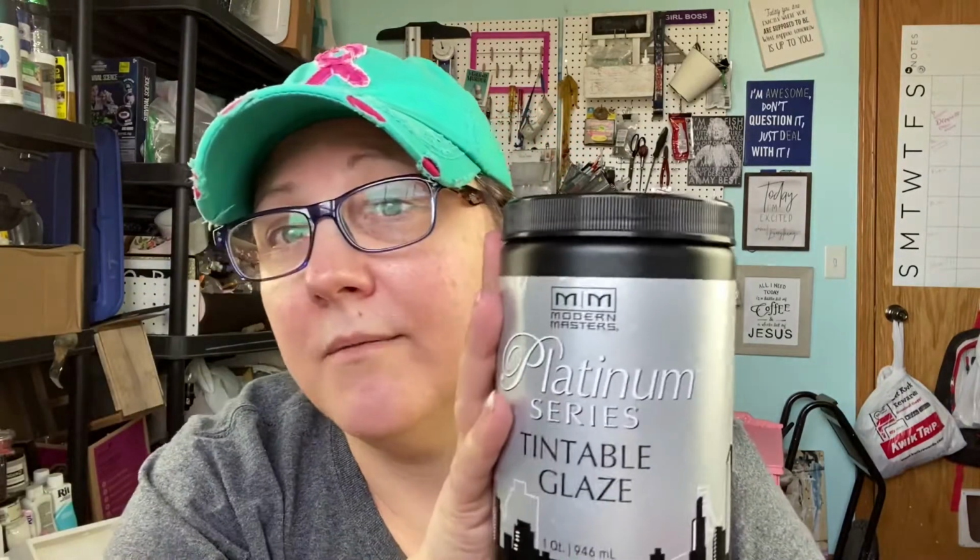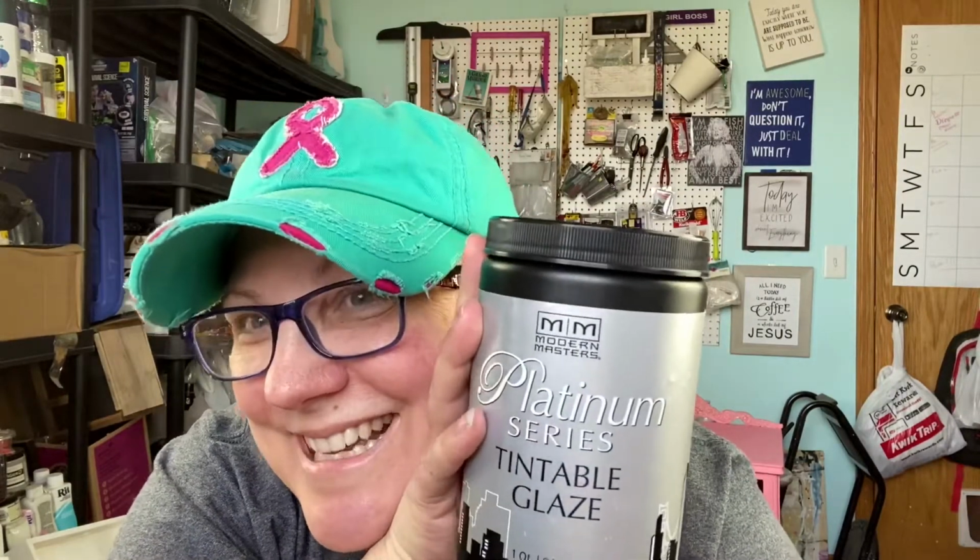But today we are going to use Modern Masters. Modern Masters again. I love Modern Masters. Mostly I just love their colors, but they had a tintable glaze. And the thing is with this one, it says you cannot use paint to tint it. Which I went, what? I didn't know that. You have to use pigments. So it says it can be tinted using standard universal colorants. Do not mix or tint glaze with paint because it makes it dry too fast. And if you're working with a glaze, you want it to be malleable for a little bit of time.